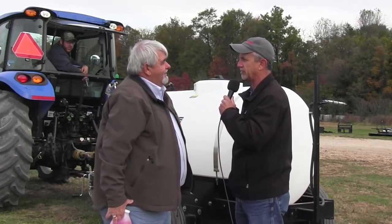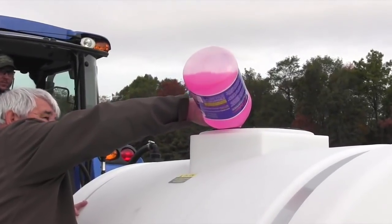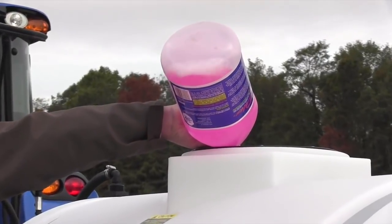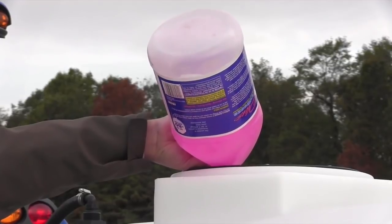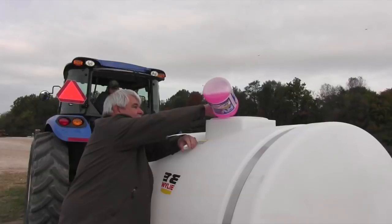How do you know to use two gallons — is there a formula? There's nothing better than the operator's manual. It'll tell you, based on the size of your tank, the amount of antifreeze needed. If this were a boom-type sprayer, we'd have to get antifreeze through all the boom lines, all the nozzles, and all the screens — probably three to four gallons. And importantly, if you don't drain your sprayer and the pump cracks, your warranty is voided. A frozen system completely voids all manufacturer warranties on fittings and everything.